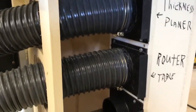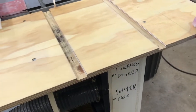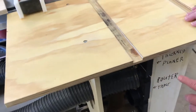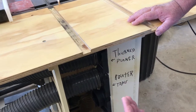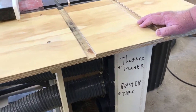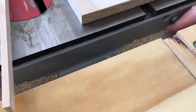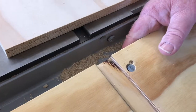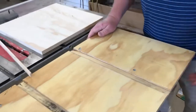The rest of this stuff is made out of three-quarter inch plywood. I got a back piece — I dado'd it in and put a back piece, so it's three sides. Then I screwed it into the saw, and to make sure it didn't slip, this angle iron right here — I moved it over and drilled a hole in it. It goes into a two-by-four below so it can't come off. No matter how much load you've got on it.